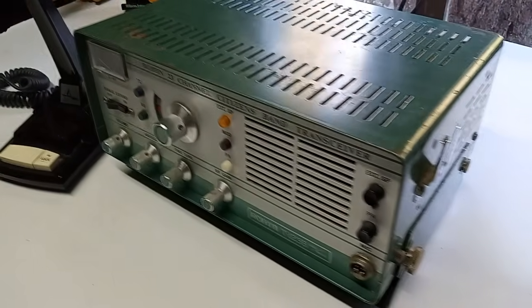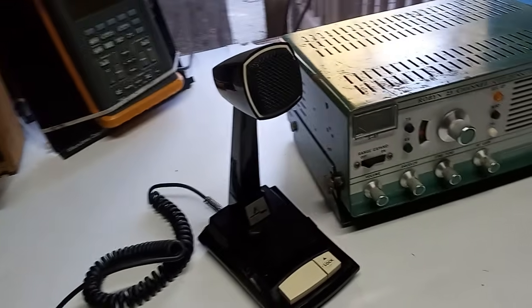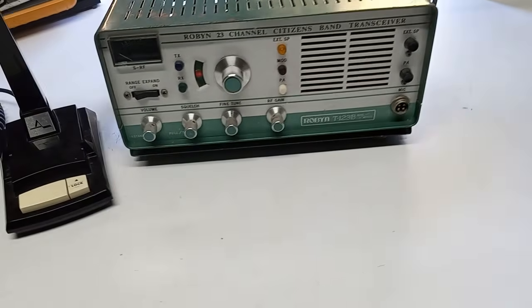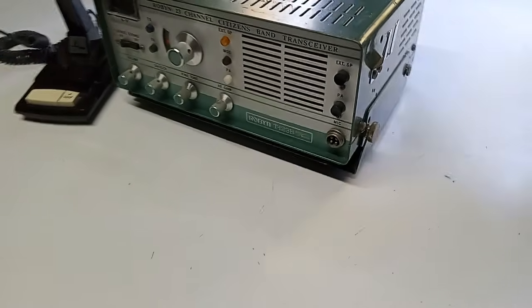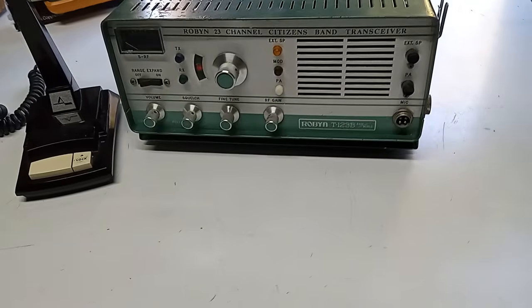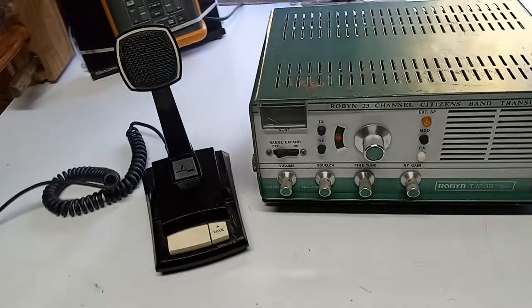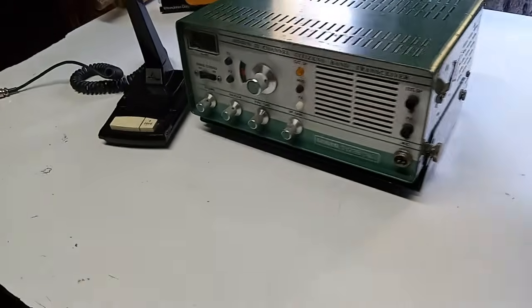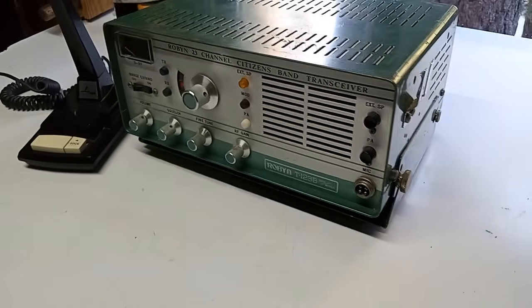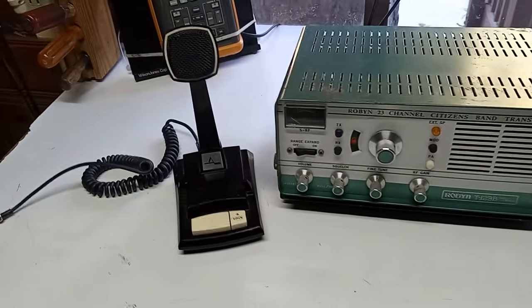They've got some oil-filled capacitors. Yes, they seep a little. That is completely normal. But on the whole, many radios approaching a half-century old would absolutely have signs of aging, deteriorating high-voltage electrolytic capacitors spewing their guts out, blowing rectifiers and fuses and whatnot. I have not seen that on these Panasonic chassis. So I told him, hey, let's just get the thing running. You're not going to be using it as a daily driver. If you are, well, let's go through the paces, bite the bullet and put some new caps in and whatnot. But if you're not, let it sit up on the shelf. I'll try to get it working for you, and we'll go from there.